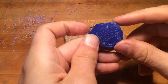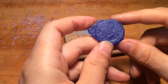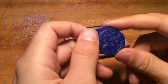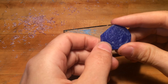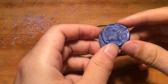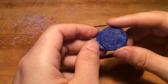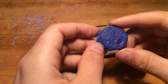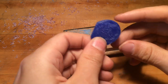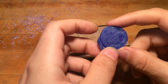Occasionally you may decide you don't want to carve, saw, or file something — you can slab out chunks that are just getting in your way. But I'm going to leave this section as a handle; it'll come in handy later if I decide to do any flame polishing or carving. It's always good to leave a handle to the very end, and then you can either gently carve it away or cut it off with the jeweler's saw. I like having a handle so I can grab onto the piece without damaging all of it.